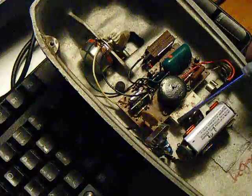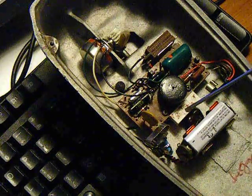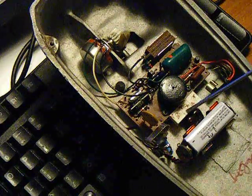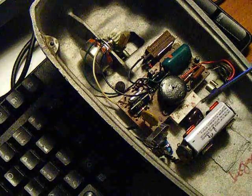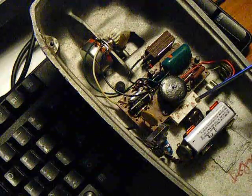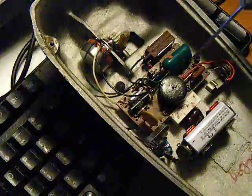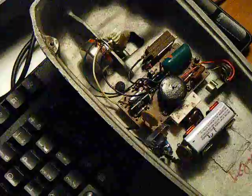This is the input volume in place of the input resistor. This is the treble bleed control — it adds highs, and also adds a little bit of a treble signal in the bass end. And this B stands for bias — it's biasing the voltage, the 9-volt side of the collector of Q1. The emitter of Q1 is actually grounded, so it's not the normal way people usually bias these. I like this a little better.